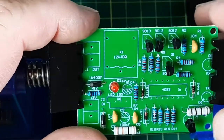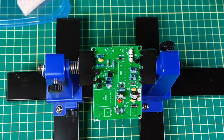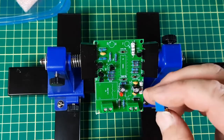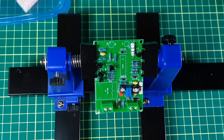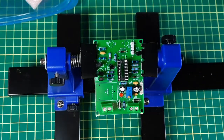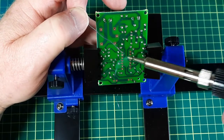I'll just flip it around. Now it's time to put on the bigger capacitors. Had to reorientate the board, and now it's time to put on these ones. Two terminal blocks — I'll just rotate it over and solder them in. And now the potentiometer. This part here is indicated by that there, and I double checked by looking at the picture. And after the potentiometer, I'll put in the socket. I'm going to have to take this — there's a few bent pins — so I'm going to have to pause and solder one of the leads on.